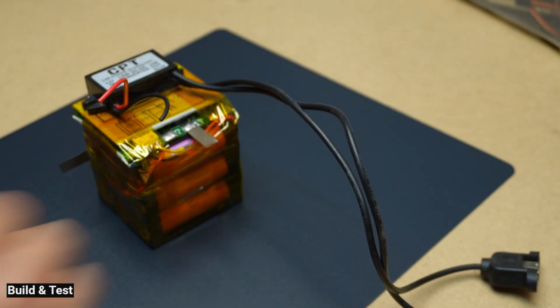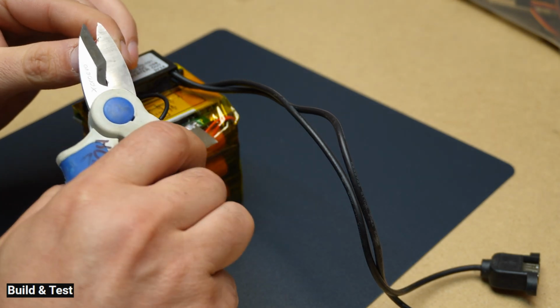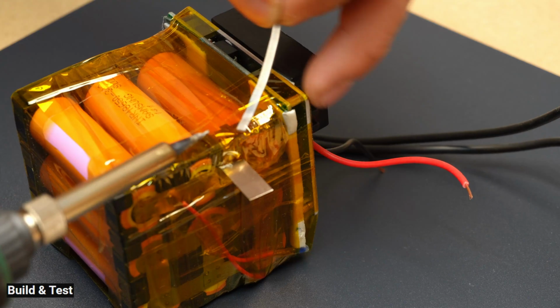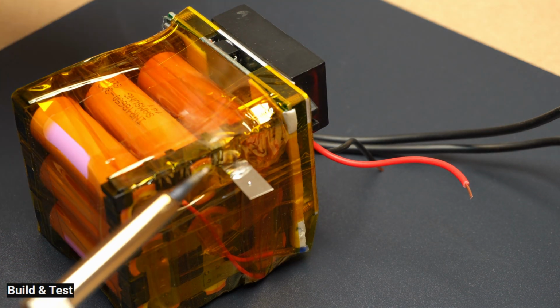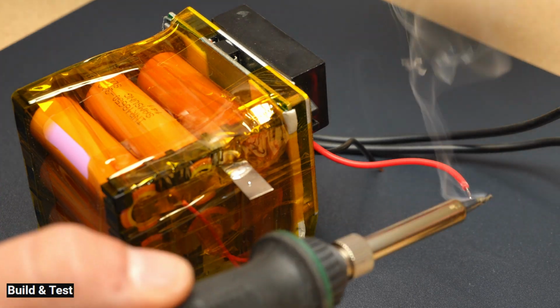How does a DC-DC step-down converter work? The operation principle is based on switching. The converter uses a transistor that switches on and off rapidly to control the flow of energy between the input and output. This creates a pulsed DC voltage. An inductor and a capacitor are then used to smooth this pulse voltage to produce a steady DC output.